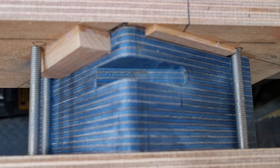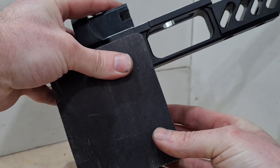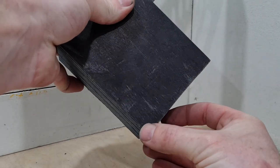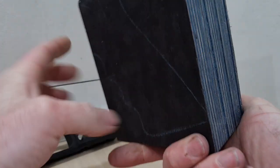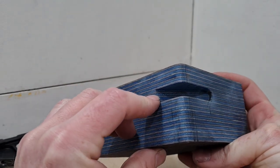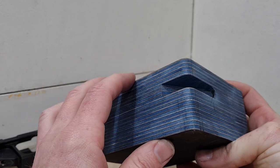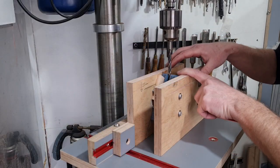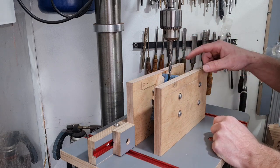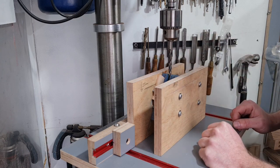That's cut out lovely. The ideal thing with that jig is I can remove the blank and double-check the fit. Now I need to drill down through the center of it, so I need to knock off this bottom corner that was sticking out the bottom of my jig. I'm going to quickly lock that corner off and then mark up from the front edge — measuring back 17 millimeters into the hole — and on the center of my slot just make a mark, then pop it back in the jig to drill it. With it back in the jig, I've marked the center of the slot width and measured 17mm back from the front edge. I've set a couple of stop blocks up, so if you were batching a few of these out you could come straight back without even having to mark them out.